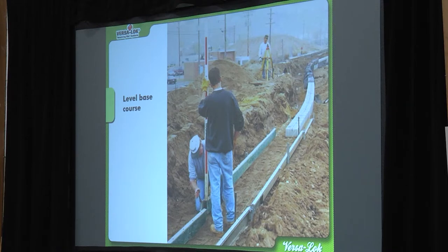This is a great way to set retaining wall base if you've got a long wall. You can see there are step-ups here, stepping up from the bottom — maybe three or four of them. It makes it easy because you've got predetermined heights on your rails, so it's a lot easier if you have step-ups on long walls to set up these screed rails. You do have to over-excavate, but that's the trade-off. Really efficient way to set it up.